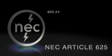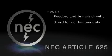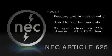625.21: Overcurrent protection for feeders and branch circuits supplying electric vehicle supply equipment shall be sized for continuous duty and shall have a rating of not less than 125% of the maximum load of the EVSE. If you have a continuous duty load, which is inherent to EVSE, a continuous duty load being one that is in place or on for 3 hours or more, it's required not to exceed 80% of the branch circuit rating.